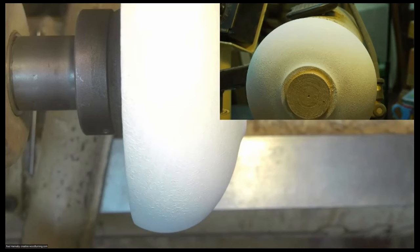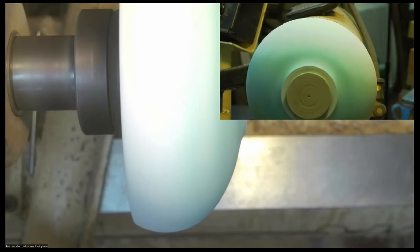This is the other one with the stipple texture, and I'm going to do a slightly different color — green and purple. I quite like this one. I'll start green at the bottom. I'm four or five inches away and you can see just a very light mist of green — fairly subtle. Because I'm running the lathe fairly slow I've got to try and remember not to move the gun sideways too quickly, because I'll start to spray spiral patterns if I go too fast. I can get carried away sometimes and move the gun too fast, so I have to remind myself to slow down.